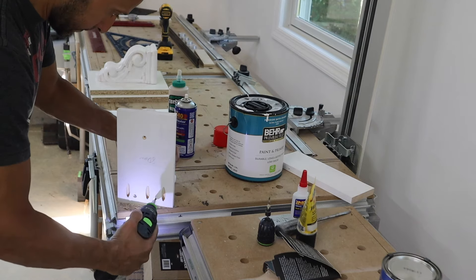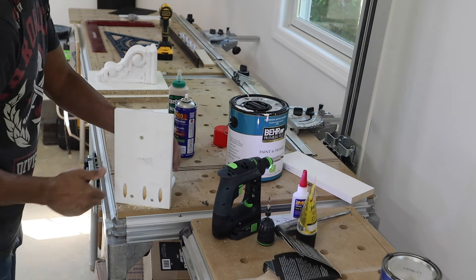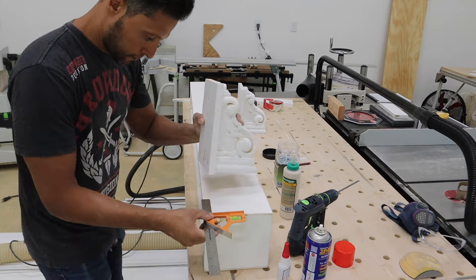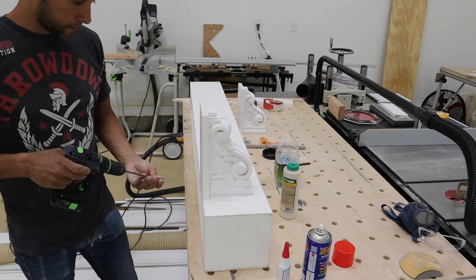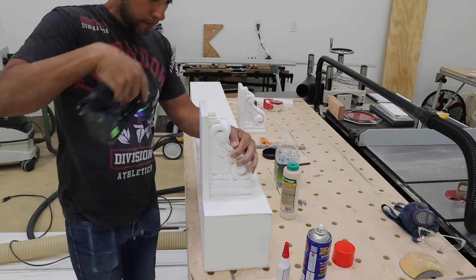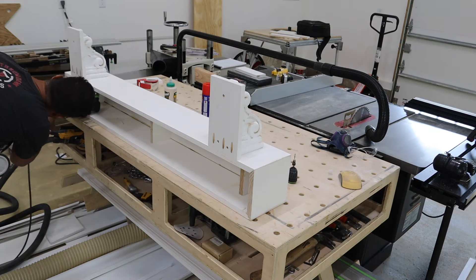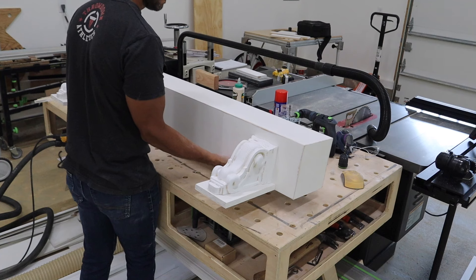The reason you need a backer board on the corbels is that if you're installing this on a fireplace and wrapping stone around it — like I'm using stacked stone — the back detail of the corbel would disappear behind the thickness of the stone. So you want to make sure it protrudes out a little bit. Now that I have the corbels attached to the backer boards, I'm attaching those to the bottom of the mantle, positioning with a combination square to ensure equal distance from each end. Always remember accuracy — use your measuring and marking tools. Apply a little glue, attach with pocket holes, then put one screw through the dead center towards the front from the inside of the mantle into the top of the corbel to ensure there will be absolutely zero failures.